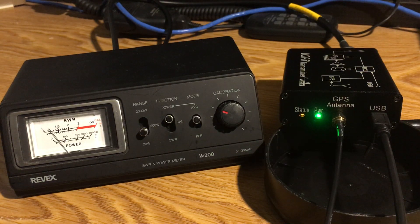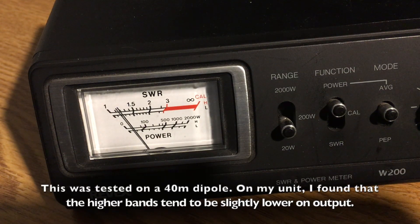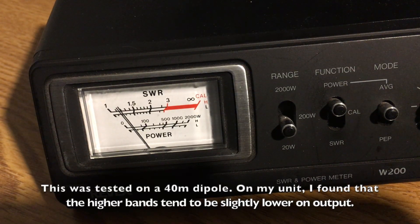There it goes — the meter needle is now registering some power. The meter has three ranges for 2, 20 and 200 watts. On the 20 watt range, the very last or bottom scale shows markers for 1, 5, 10 and 20 watts. You can see there the meter needle is reading just under 400 milliwatts. On this old meter it's very hard to see low power in the milliwatt range, but we can see the signal of at least 300 milliwatts is getting out.